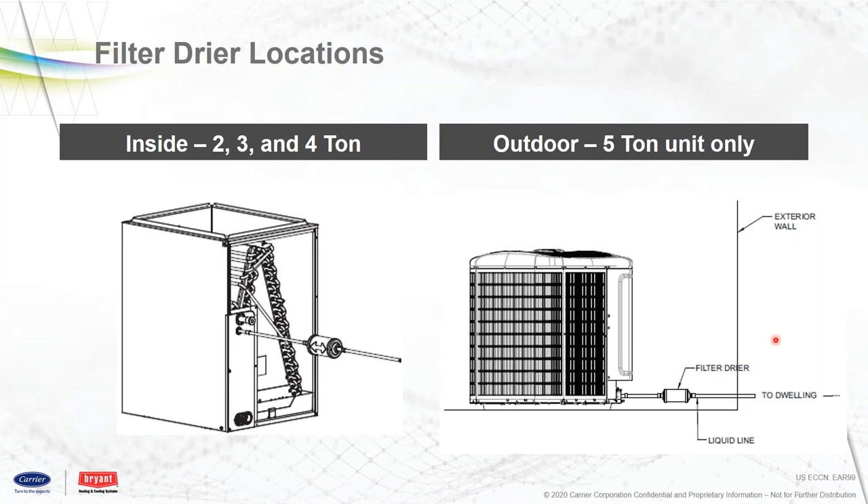Q: Is the unit UV-safe — is the plastic coating UV-resistant? A: On the unit, it's the same epoxy paint used on all of them. Regardless of the type of epoxy paint, eventually everything will break down from UV when it comes to coatings, plastics, and paints. But yes, it is a UV-resistant paint. The grills are as well. The plastic cap on the top showing the Bryant crest or Carrier oval — over time you will see some wear on it. If you wash and wax your condensing unit every year or two, it lasts like a car. Even car paint will eventually change color slightly from UV.